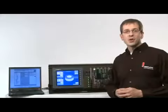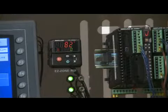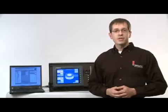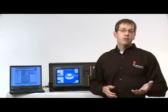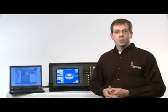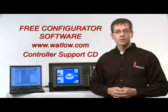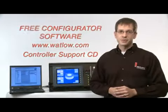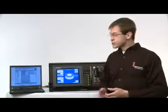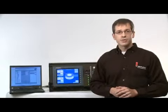A simple way to operate the Easy Zone RM is utilizing the Remote User Interface, or RUI. The RUI gives you a full display so you can set the parameters of the Easy Zone RM. Simply connect it to the standard bus and it automatically communicates with the control module with no configuration needed. Just like the other Easy Zone products, you can utilize the Watlow Configurator software, available free as a download at watlow.com or on your controller support CD. For a more sophisticated interface, you can use an HMI communicating with the Easy Zone RM via one of the industrial protocols like Modbus RTU.